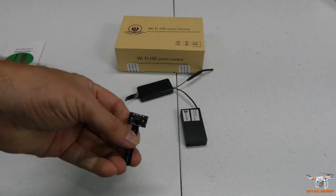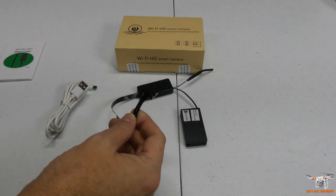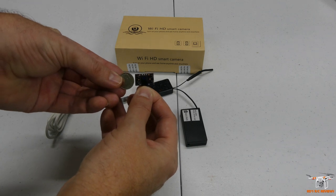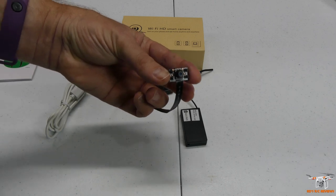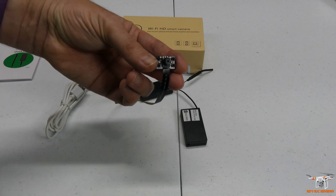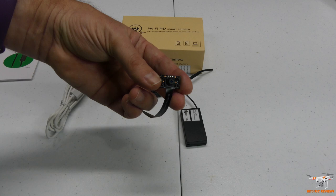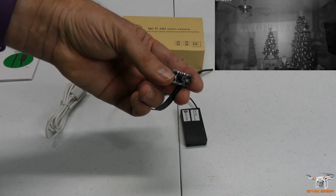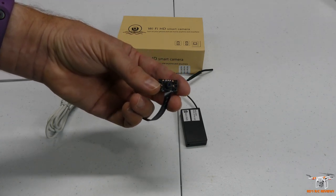Here is the camera on its ribbon cable. If I put a dime next to it you can see just how small this camera is — extremely small. There are four little infrared bulbs on here, and they illuminate in the spectrum outside of what a human can see. The camera can see it and illuminates the room, so it looks dark to you but the camera can see everything in a darkish grayish black and white.